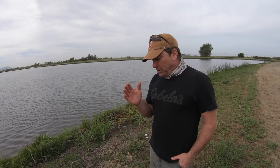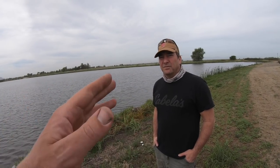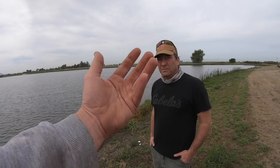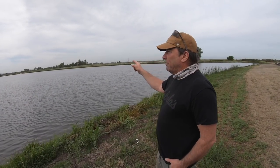Yeah. But I wonder how much does he add for windage on that? If he's got a little bit of a crosswind, does he slide it one way or another, or does he just take a no wind cut at it every time and let the wind do its thing? If I had to guess, I would imagine he just stays his line. Yeah. So he consistently gets carryover due to the wind. Mm-hmm. And then maybe based on where the wind is coming from, make an extra pass on the side where the wind is blowing. Got it. Does that make sense? And that's where the spotter, wherever he is, maybe can fill him in on that and then fill in any gaps. Right. Might have been created by the wind.